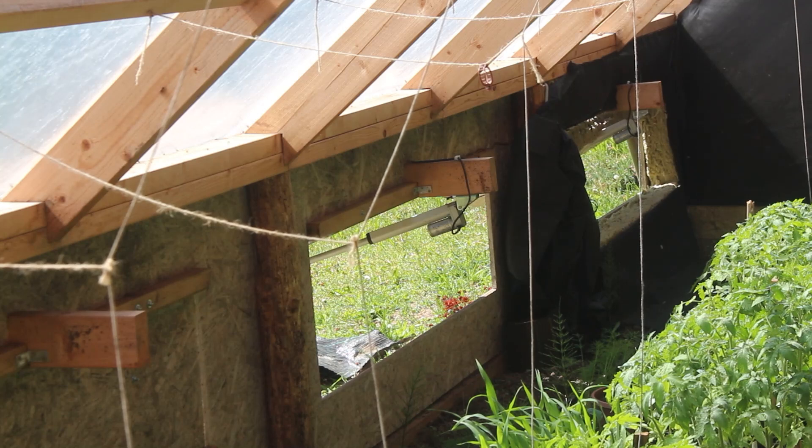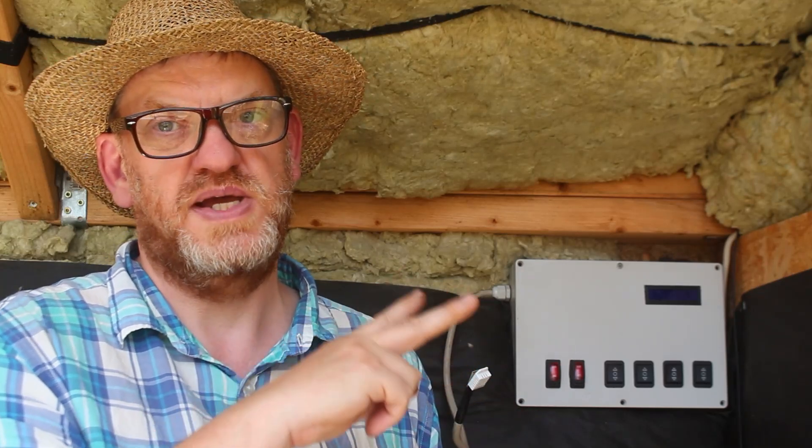Point number four is elegance — the elegance of solutions. I probably went for simplicity in some cases where I should have done a bit more research. The window actuators are switched polarity to work: when it's positive and negative on two pins, it opens; and when you switch the polarity, it closes — and it switches itself off when fully open or fully closed. To do that, I used two relays per window to switch the two polarities — positive and negative on one relay and positive and negative on the other, switching in opposite directions to control that.